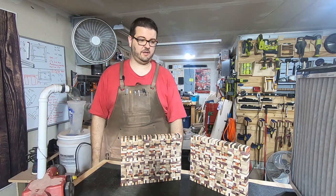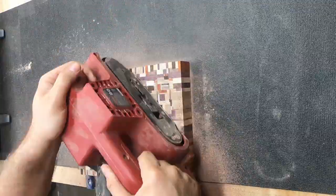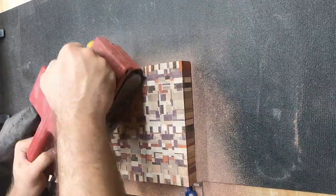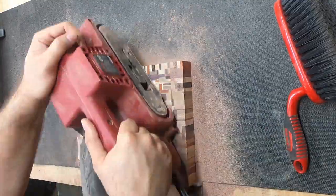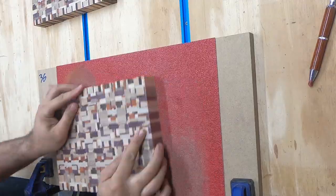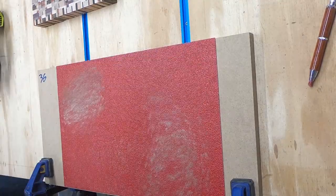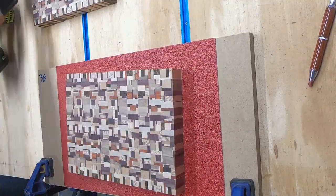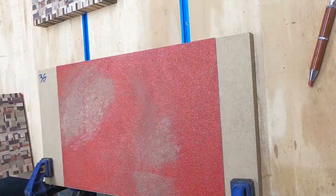I hate sanding — well, I love to hate sanding. End grain is very difficult to sand down, especially for some of the species in this board like the Purple Heart. The 36 grit belt does make quicker work of it, but it still takes a very long time. My goal is to sand until I cannot feel any transitions between the wood pieces. I'd say I spent about 45 minutes just with the belt sander to get things as smooth as I could. After smoothing, it was time to try to get these flat. This would be the perfect job for a drum sander, but those are expensive and I don't have one. So instead I'm using a large sheet of 36 grit sandpaper on a flat piece of MDF and using good old elbow grease to knock down any high areas — another 45 minutes. I eventually get it close enough that I'm happy with the results.